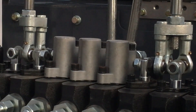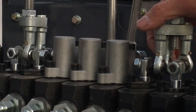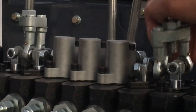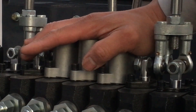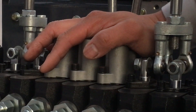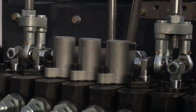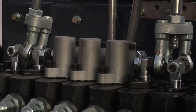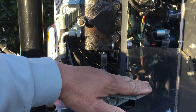The valve is fixed at a point which acts as a stationary pivot, allowing you to move the actuators. In a real-world digging situation you might do three actions at once: pulling the big digging arm, retracting the small front digging arm, and scooping. You'd be pulling the big arm back, scooping to the right, and retracting the front digging arm — then rotate to dump and come back and repeat.